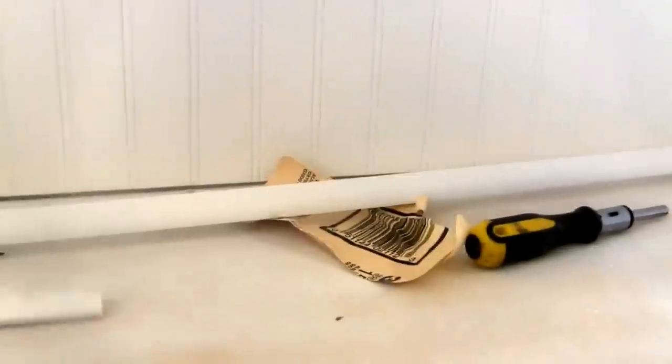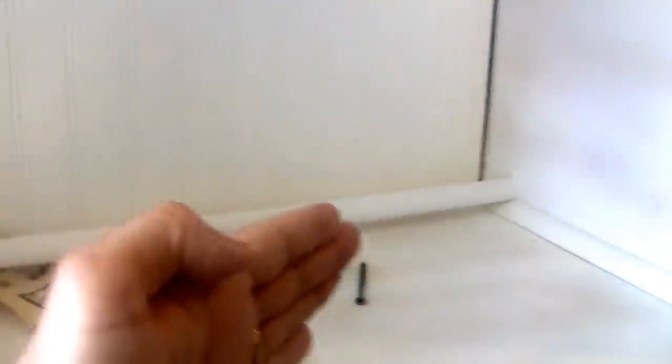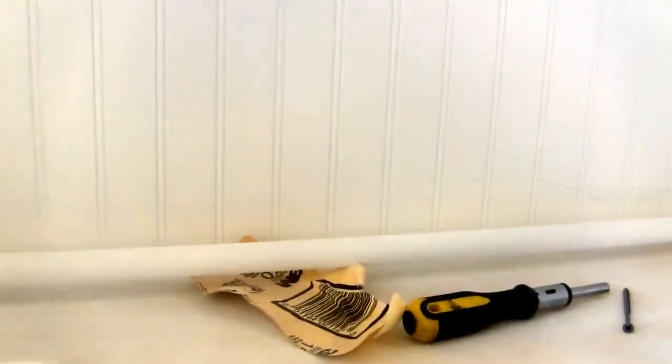You can see it looks a little rough on the inside, but on the outside it looks nice and pristine and slides in there extremely well. My next step is to lay out all the base pieces along here — cut each on the 45 coming in, cope out the insides, and lay them in. The tricky one has to be cut in on both sides and then coped out, so that's the most difficult. I'll leave that one for the end.